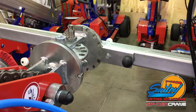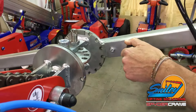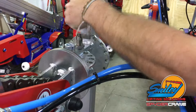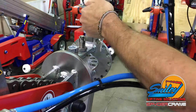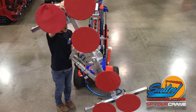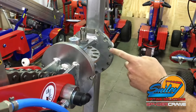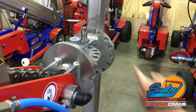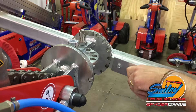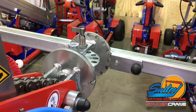To rotate the suction frame, depending on the MavLift model, either pull or twist the black knob at the top of the frame joint and release to set. When using these functions while manipulating glass, ensure that the frame is in a central position to neutralize the weight of the load before releasing the locks. This will make it easier to maneuver the glass and ensure smooth movements.